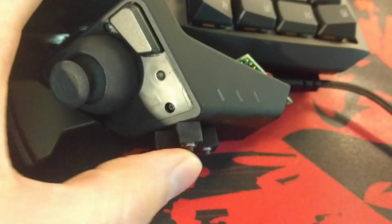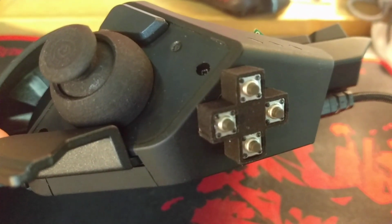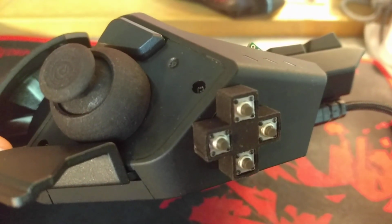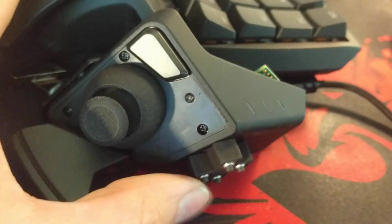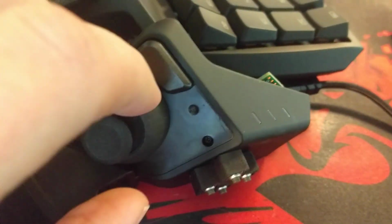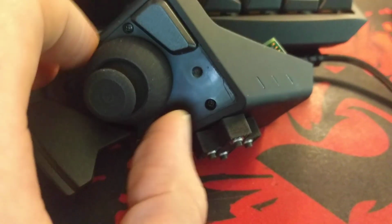This is another 3D printed part. I'm calling it the Dpad harness. And it's got 4 square holes that these Alps switches go into. These dust-free switches, and you feed wires to the bottom, and then it goes in here, and this is actually soldered to that factory PCB. So this is the factory Dpad, basically, with different switches and relocated. So in this mod, the factory Dpad goes right here. We have to remove it to put the stick. Well, instead of just leaving it removed, I just relocate the Dpad to be right here.